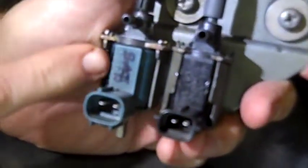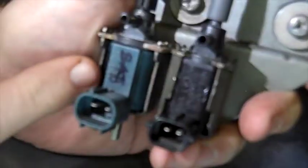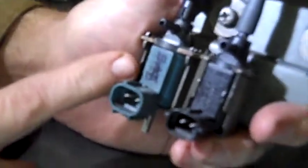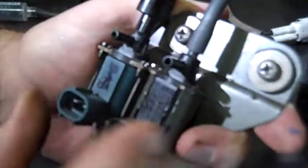There's one more test you can do: if the valve is good the resistance should measure between 30 and 38 ohms. You can see that I had written 'bad' on here and then crossed it out. The first time I did the ohm test on here it didn't pass, and I thought it was bad so I was going to throw it out. I did the battery test on it and it seemed to work, and then I did the resistance test and it tested fine. So if it's been disconnected for a really long time you need to apply some power to it before you test the resistance. I don't know why. That's about it — that's how the system works.